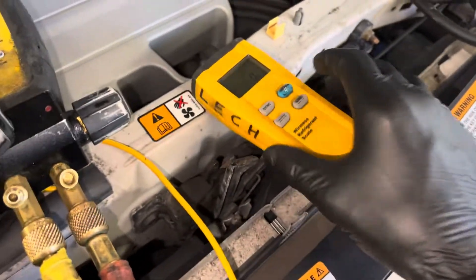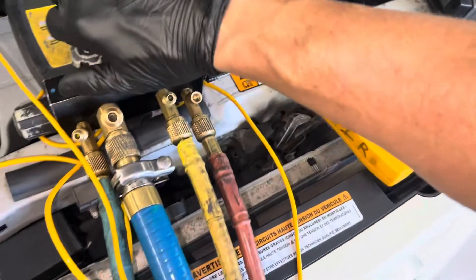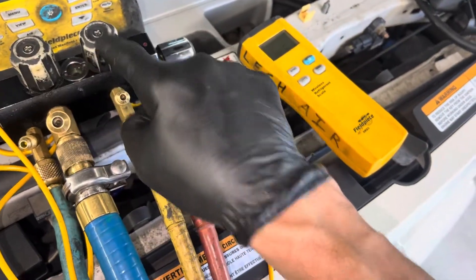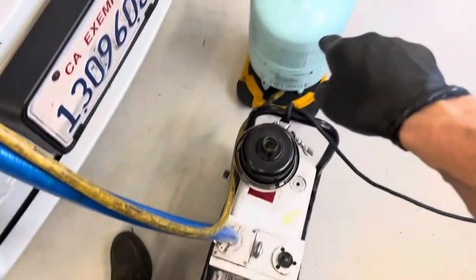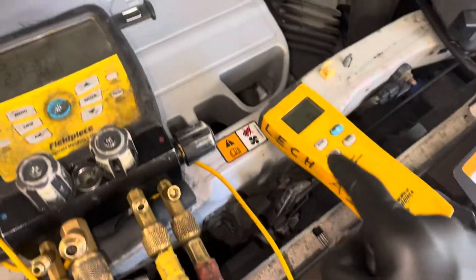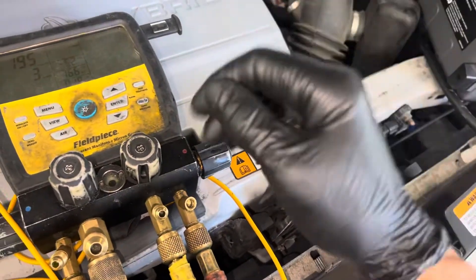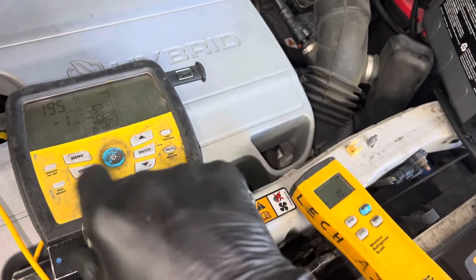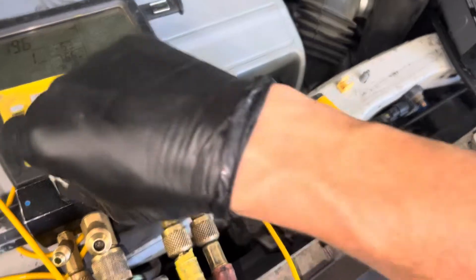Okay, we are going to kill — what I mean is turn off the vacuum — and we're going to open up the refrigerant line that goes to the container and put in 1080 grams, plus or minus a few grams. Let's kill the vacuum, then open up the scale.